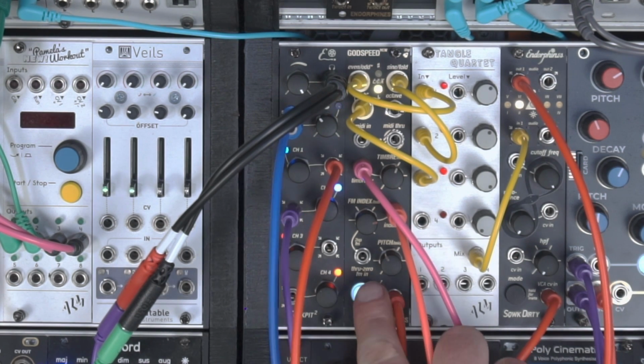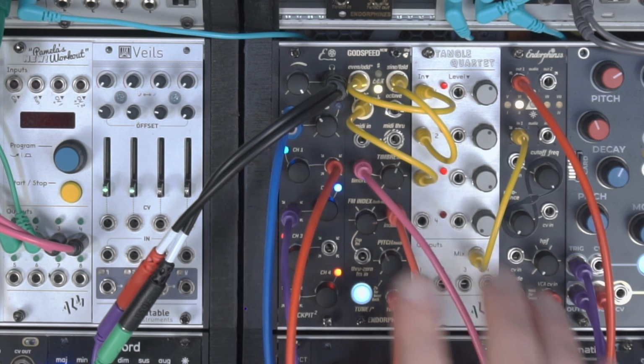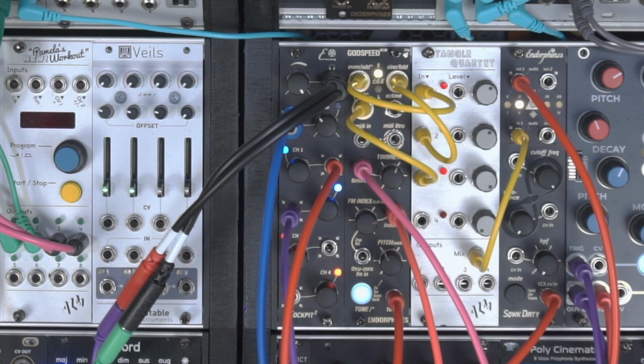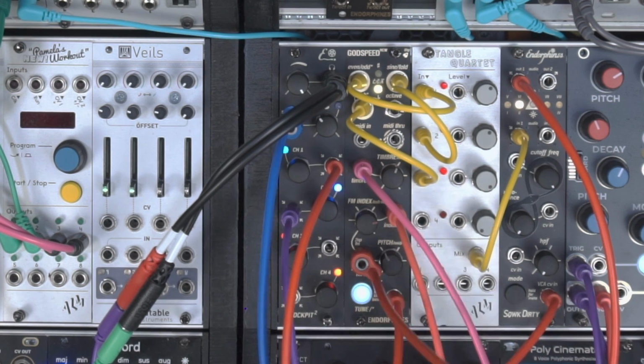So we also have this thru-zero FM input as well. Now this is an AC coupled thru-zero linear FM audio input, and it takes minus to plus 5 volts. Its level's attenuated by the dial as well, but there's also an internal virtual sine wave, the identical frequency of the oscillator that's been applied when nothing's patched into it. So that sine wave's kind of interacting with that in a way. So you could plug some audio into this and make it interact.